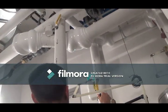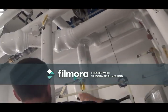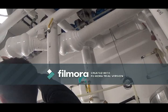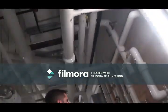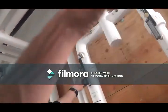I'm not sure, it's reading 150. So I think that's boiler water, not tank water. That's like the temperature in here, and you don't have one on that pipe. It should be 150, and then you mix it, right? I'm just not sure what we have. See, our tank's only at 140. So I think what he's looking at is the boiler water.